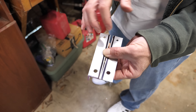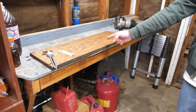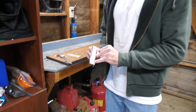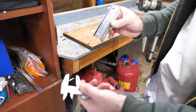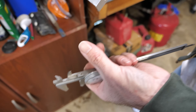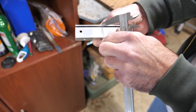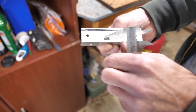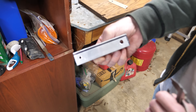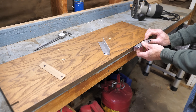These two holes are for mounting the parts to the motorcycle, and the two on this other side are for attaching the part to my work table — an old piece of particle board shelving. The first thing I want to do is trim this dimension down to .857 inches. I put a nice Sharpie line on here so I can see my scribe mark. My goal is to trim this entire length down to where that line is. That would be tough to do with a hacksaw anyway — this may save labor as well as producing a nicer part.